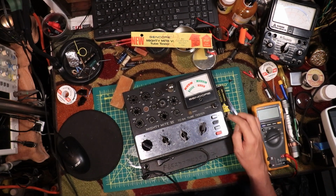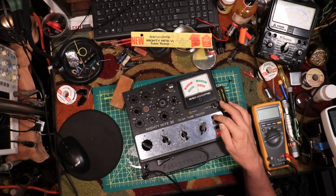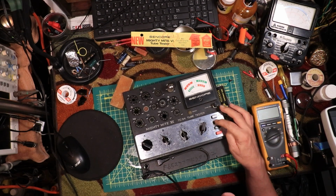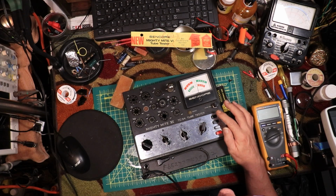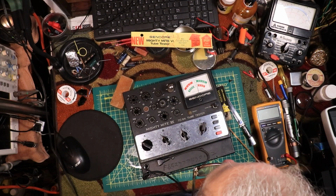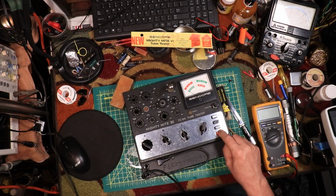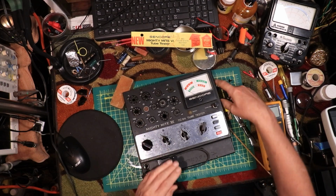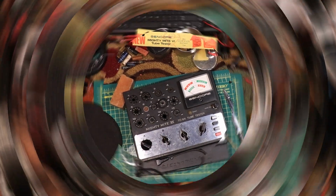Okay. Emissions. Same thing. It's not right. And the grid leakage is way back there. That should be over here in a good position. That tube should read around 90%, if anything, so it's off. So I gotta do some troubleshooting.